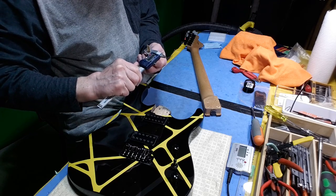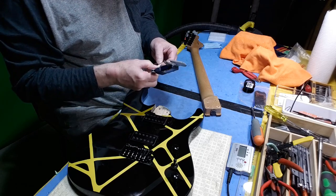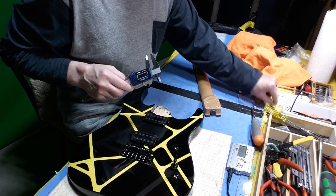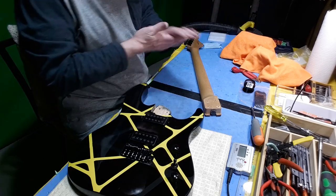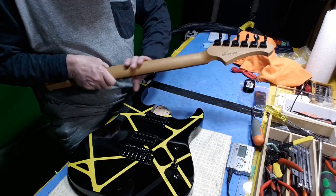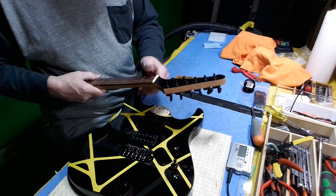On average, it's about 0.38 to 0.40 millimeters. I may use something else later to get what I really need. I'm going to have to clean this up as per usual. I noticed that down here it's nice and smooth and satiny, but here it's satiny but not as smooth — so I'm just going to have to touch that up with a little bit of Scotch-Brite. All of the ferrules were tight.